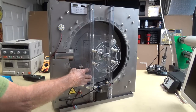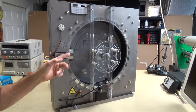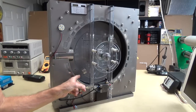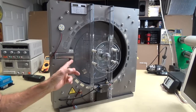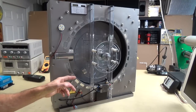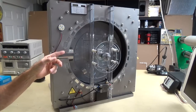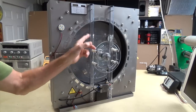You see, it's real close, and the reason for that is that the electromagnet has about 1/8 of an inch thick case that's steel, and that magnet is really attracted to the steel, and then the core of the electromagnet is the exact same diameter as the magnet itself, and so this magnet is extremely attracted to first the case and then the core. And so what you want is you want this to leave the exit point, which is the end point right here, and the beginning point is here. So at the beginning point, you always have this really strong repulsion. This particular magnet works in attraction on this spiral.